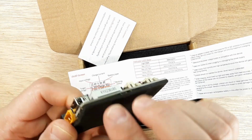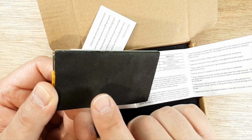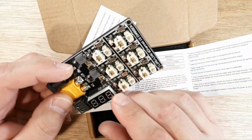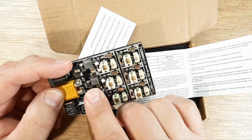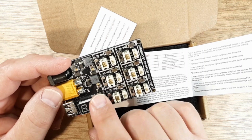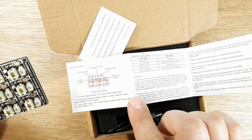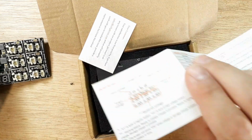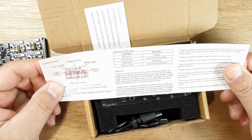The voltage regulator, I don't want to really peel this off, but the voltage regulator inside here cannot handle 26 volts. I actually was using a 24 volt power supply running these, and I've melted a half dozen of them. This thing really performs best on 12 volts. So I'm kind of interested what input voltages we have on this one. We'll go through that in a second.